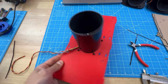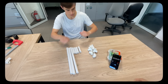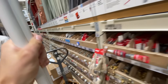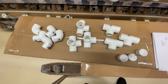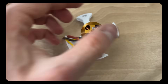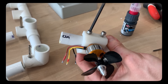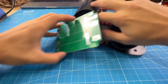Just so you know, in our first and second prototypes of CPS-3, we tried using PVC pipes for the entire frame of the drone. However, first of all, it turns out that for some reason these joints are pretty expensive, and second, we couldn't figure out how to mount the motors well without using 3D prints. So that's why we scrapped that idea and opted for the CNC cut sheets. Now let's do the electronics.